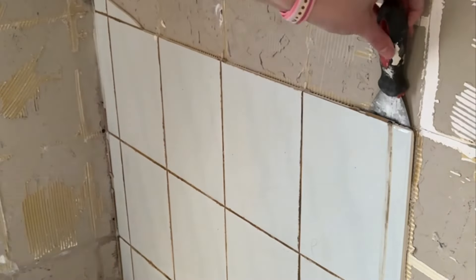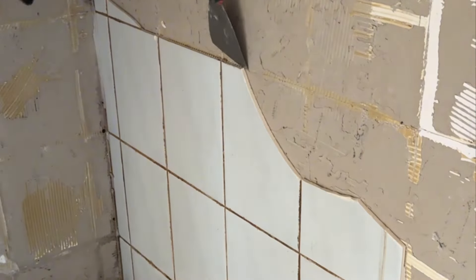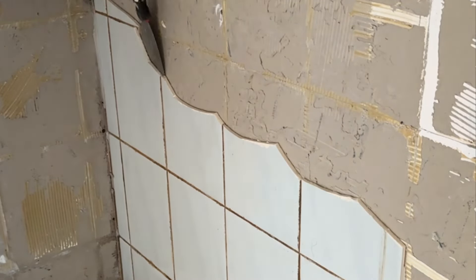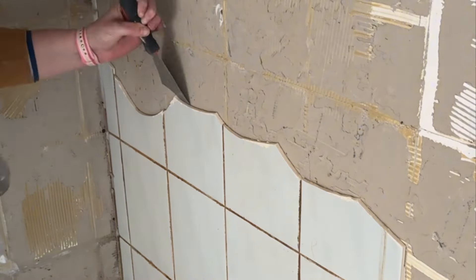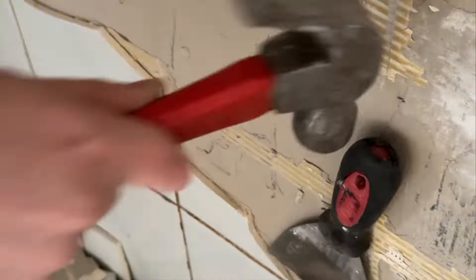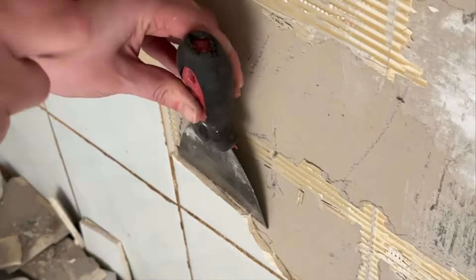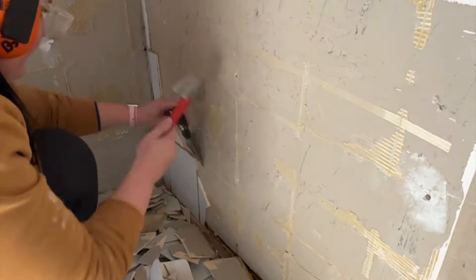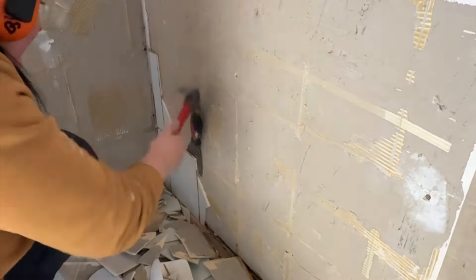I was reasonably lucky in that I had cement sheeting behind these tiles, which meant it was going to be a little bit easier to just pull the tiles off the wall. If there had been plaster behind the tiles, pulling them off likely would have just put holes straight through the plaster. So if your bathroom has plaster behind the tiles and it doesn't appear to be working, it's probably going to be easier to get a multi-tool, cut the plaster and tiles off in one sheet, remove that completely from the wall, and then add new plaster.